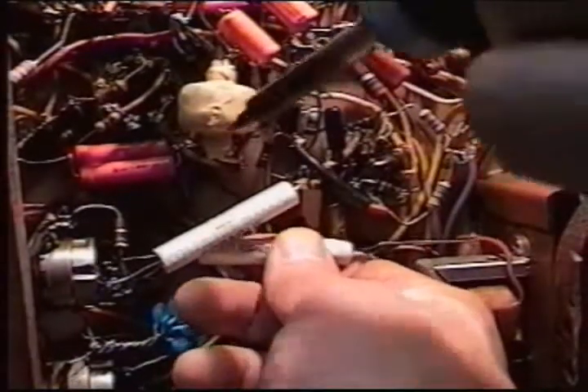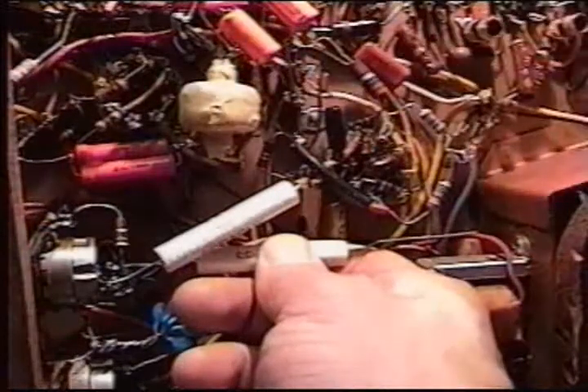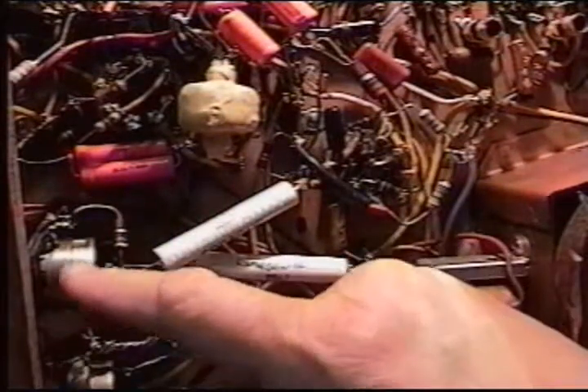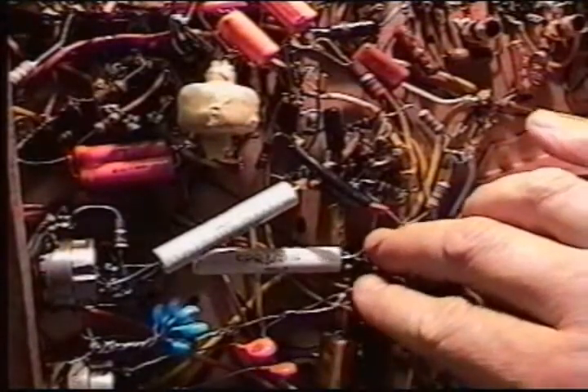Now we're going to go up there and clip up there — soldering it onto the back of this control, which is the tie point of the capacitors in the high voltage circuit. What this is here is a bleeder resistor network. I'll put my soldering iron down here and give it a little 90-degree bend to go into here. What we are going to do is clip this back just a little bit. Nothing too drastic — if we cut the leads too short, we're in trouble. I'd rather cut not enough and go back and take more if necessary.